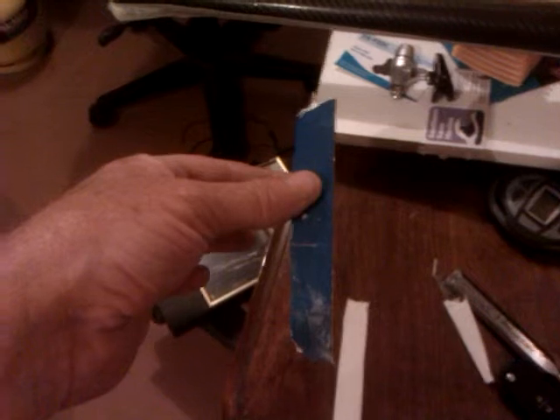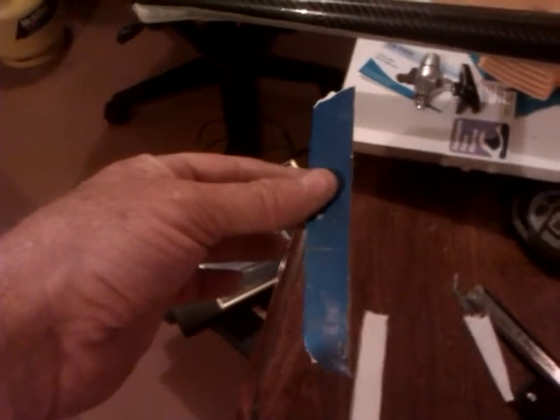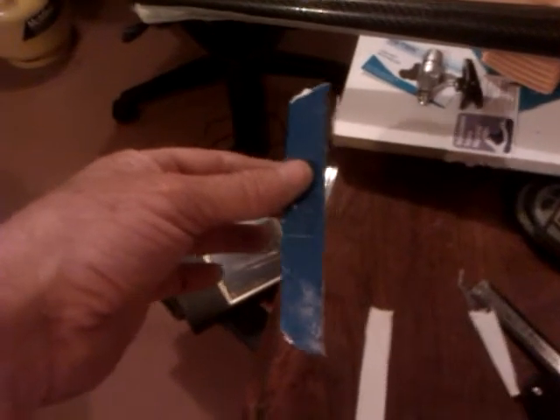Without a micrometer, the same thickness — I'm not doing this as a trick or anything, this is just showing you the difference in the way that the parts are manufactured. This is done in a process called RTM, where they put a little bit of fiber in a mold and then inject the resin into it. They're probably getting about four times as much resin as fiber, which is not a good ratio — one to one is a good ratio.